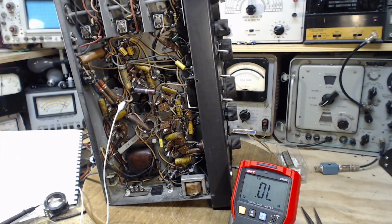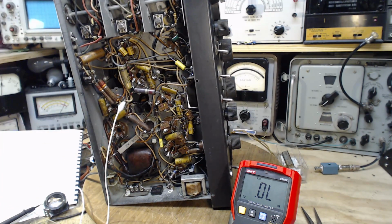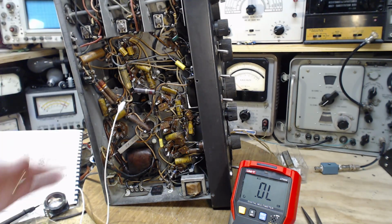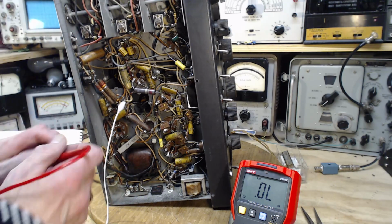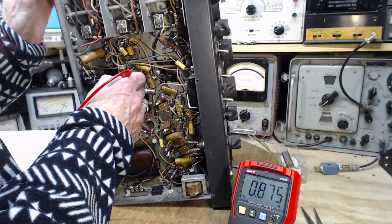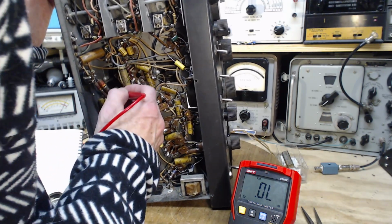And you could argue, wow, okay, if it's gone to 1369 and they said it's cold right now, warm the setup, maybe it's going to go higher, and where's it going in life? It's only going higher in life anyway. So put a proper 1,000 in here, assuming this is correct. I don't know what else to do. And we'll get rid of that one. While I'm here, why don't we take a look at this 330 one? 875. Oh my gosh, these are all shot.